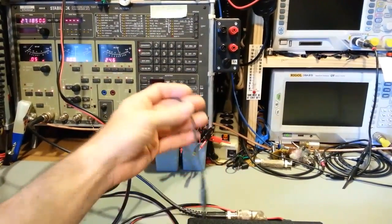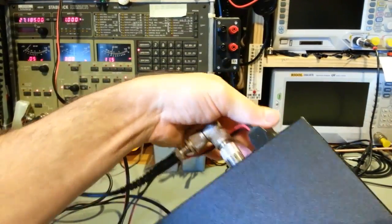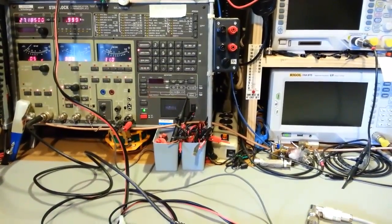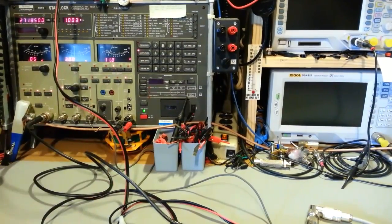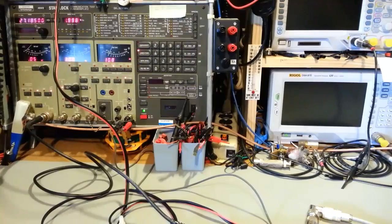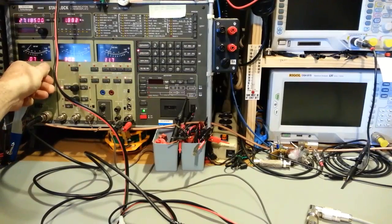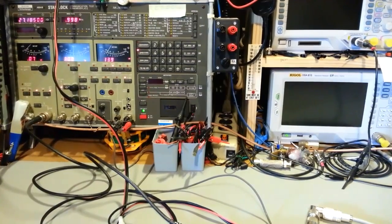And actually, let's hook up the communications test set to the external speaker jack here. So now the speaker dummy load is actually coming out of the speaker in that. It's got like a 10, almost 11 bouncing around there a little bit, but dB SINAD at 0.05 microvolts, minus 133 dBm. That's actually really good for AM. Usually AM can be, shoot, half a microvolt good for 12 dB SINAD. This one, I'll probably only have to go up like 1 or 2. Yeah, so 0.07 microvolts, it's up over 12 dB. 13 to 14 dB SINAD, it's bouncing around.